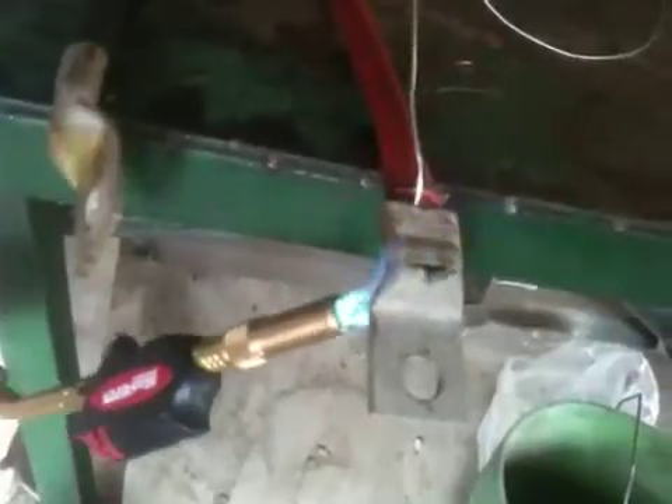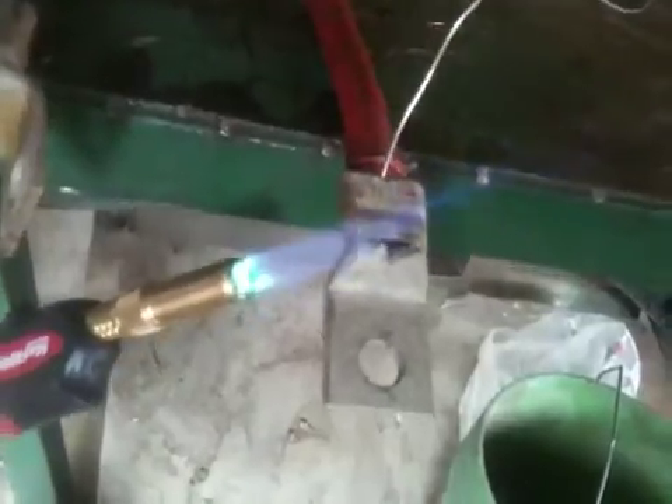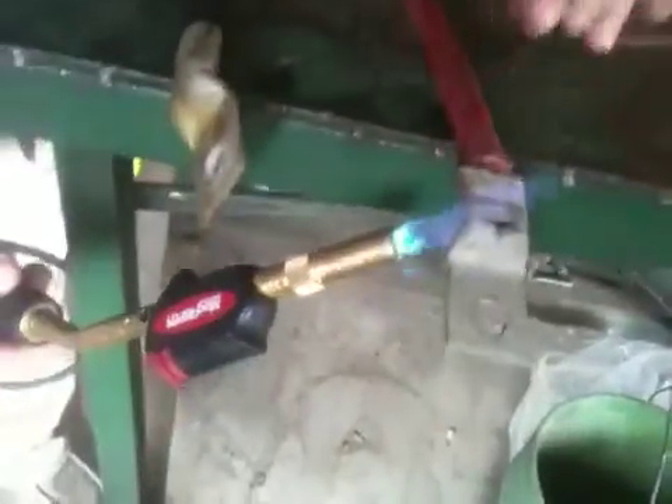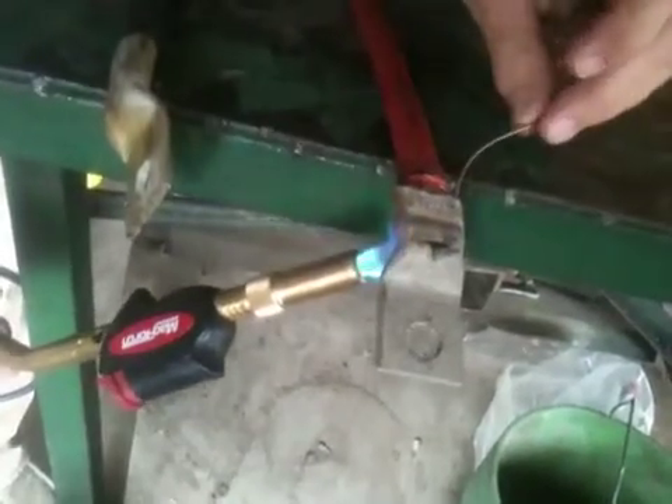What it's doing is just sucking right into there. See, I'm heating it clear up here so it's going to pull the solder clear down in there — even on the side where it's hollow — just keeps filling it in there. What it's doing is filling those voids up so you have more surface area to spread the amperage load across.